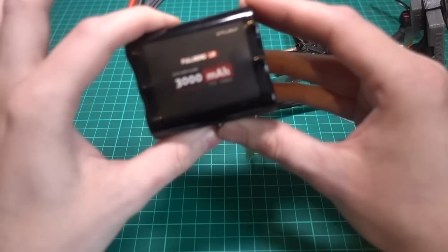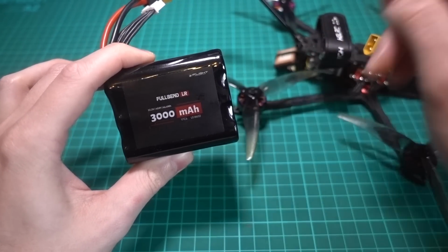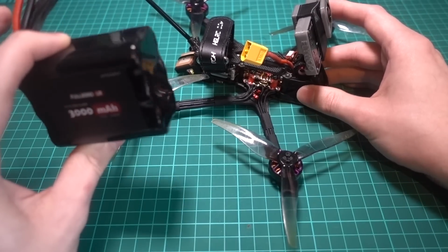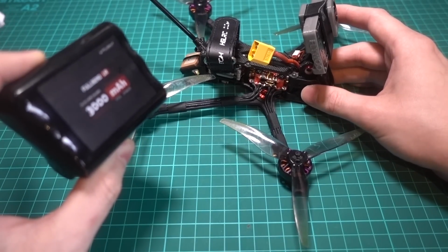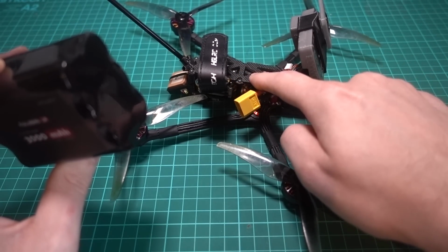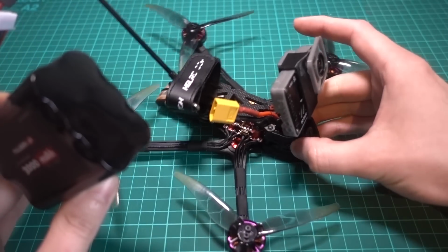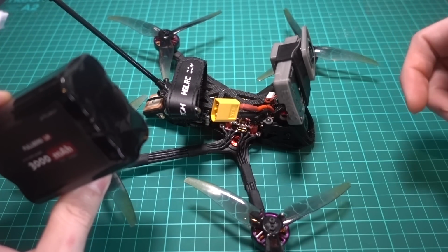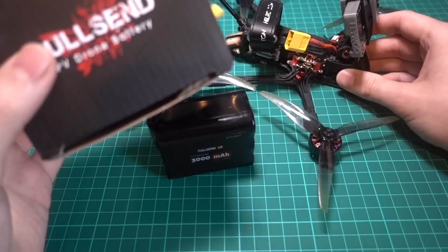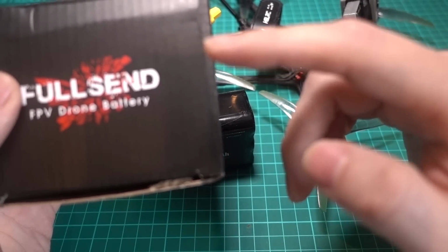But I think a lot of people tried these and landed them at the usual voltage you would a LiPo and go, oh, I only got 10 minutes. Actually, you'll get 31 minutes is what I got out of this. And because this guy is probably not often asking for 30 amps because it's so small, you could even go up on the throttle and do flippy flops and that, which is something that you can't do so much on the 4S version because of the current draw.